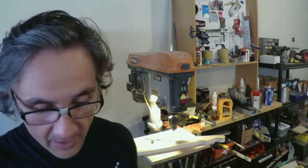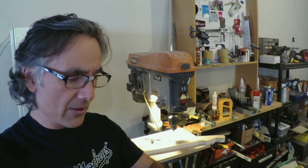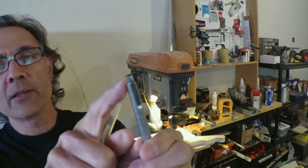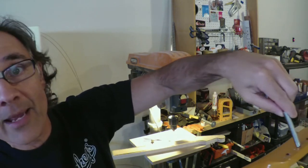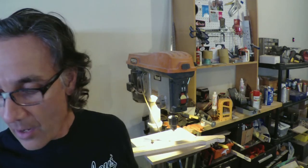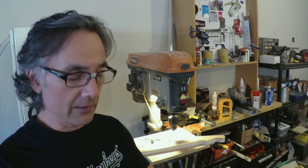So I use these, which is something you could get from StewMac, and I'll show you. It's a reamer, and what it has is a little quarter inch tip on there that can go into the quarter inch hole that you drill out, and then it'll ream out a flat-bottomed, countersunk hole that you can press the ferrule into.